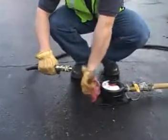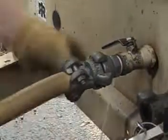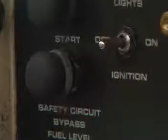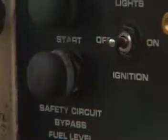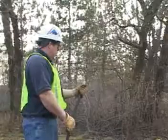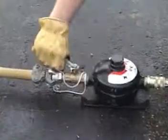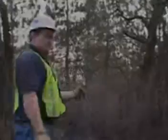Use all safety equipment, including safety clips and lock rings. After all connections are made, start the air compressor. Hold the tool supply hose, pointing it away from yourself and others. Then, partially open the oiler valve to blow the air hose clean. Be careful not to lose the rubber seal inside the hose coupling.